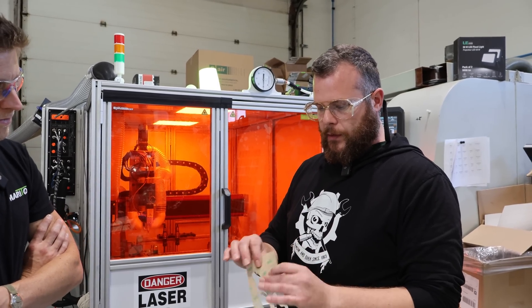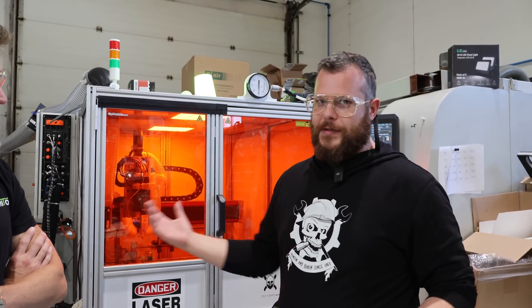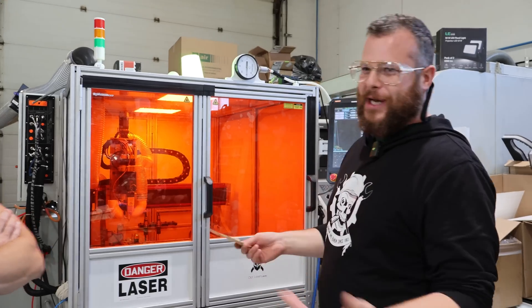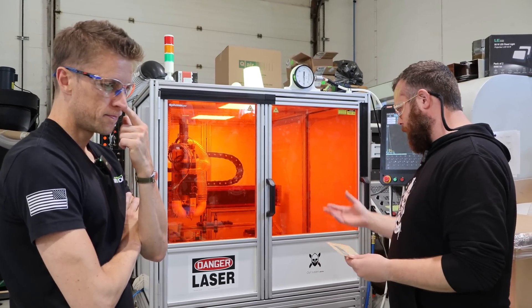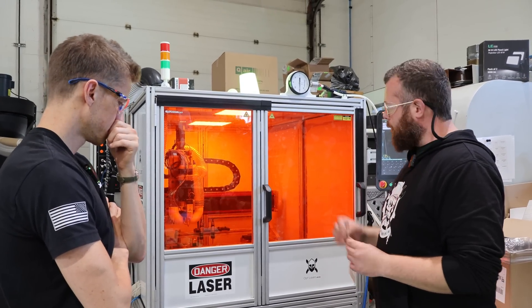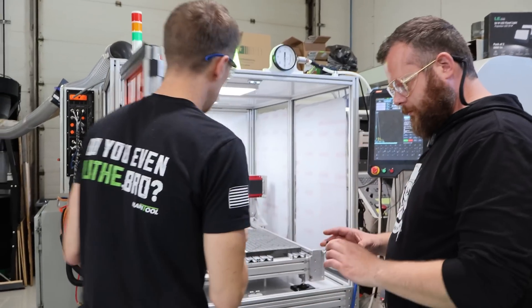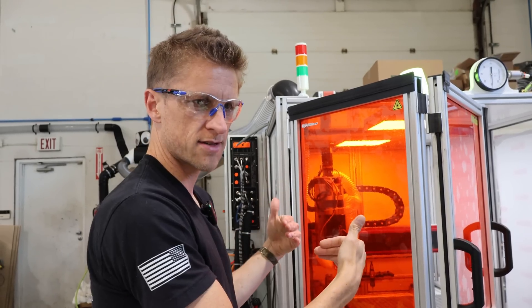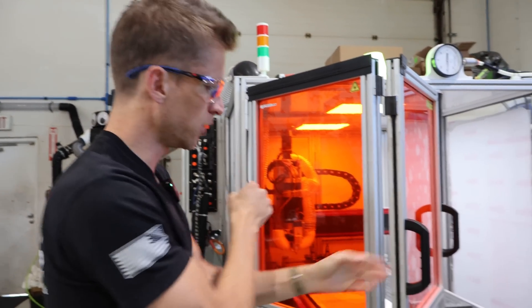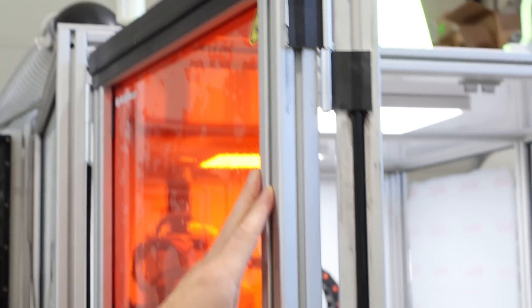The reflectiveness on one side of the tape is different than the other side, so it'll actually cut at a different rate. The color of the paper makes a difference — put one color next to another and it's going to cut differently. It's kind of different than what we're used to. Everything matters. We've got our orange reflective shielding here which blocks the UV light at 450 nanometers — that blue light from that specific laser. We've got a lot of little guards so everything is totally shielded and no light comes out of the seams and gaps.